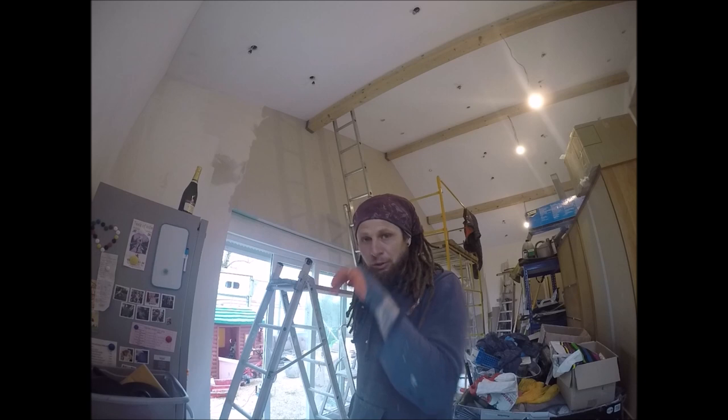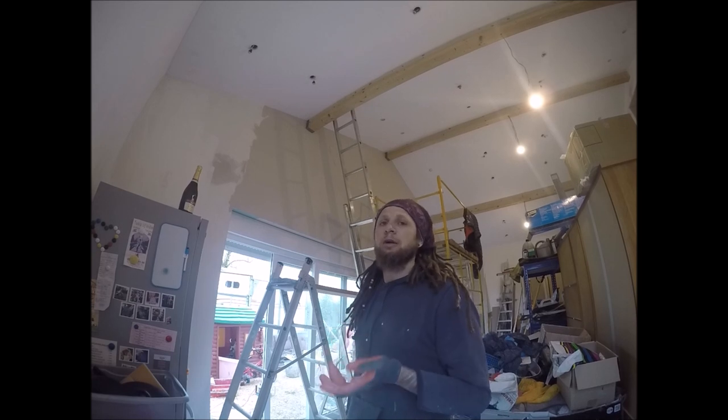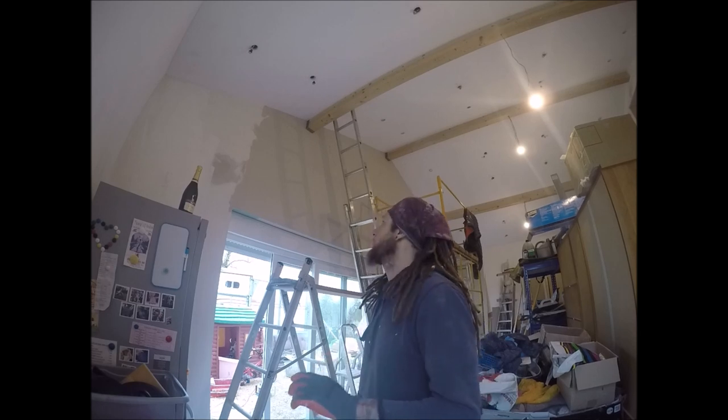Okay, so the plaster's been on the wall a few minutes. We've just cleaned all our kit up. We know from experience it's better to just flatten it off straight away. Sometimes, if it was mouldy, for example, you can leave it a little bit and then flatten it, because it stays quite wet. This does not normally stay very wet for long.